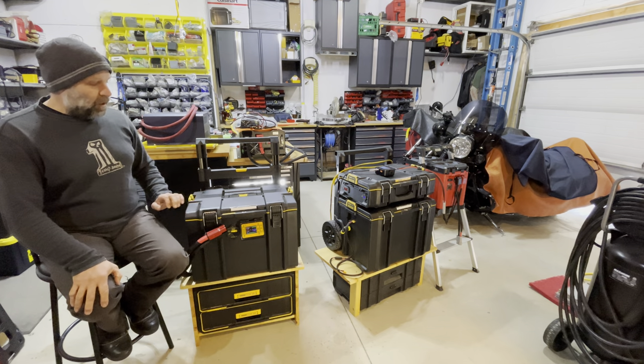As it's set up as a 24-volt battery, I still have a buck converter inside to take that 24 volt down to 12 volt for the side peripherals — so your cigarette lighters and USB-C chargers are on this side, converted to 12 volts. If you have a trailer that's 12 volts, you'll need a secondary device outside, which will cost another couple hundred dollars, but then you can charge everything from one central spot and still take advantage of a 24-volt setup.